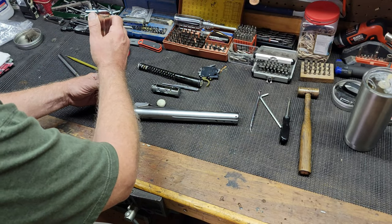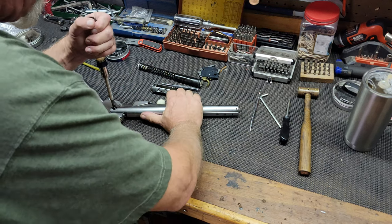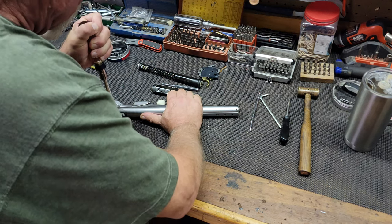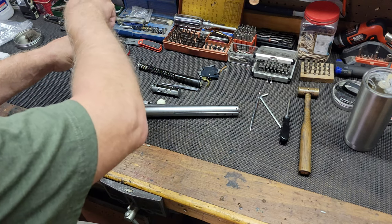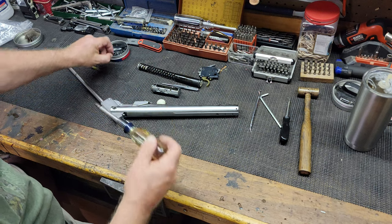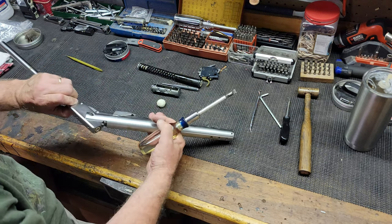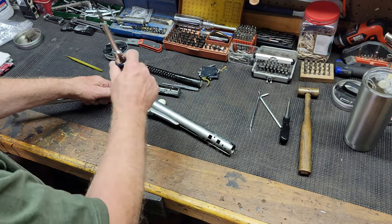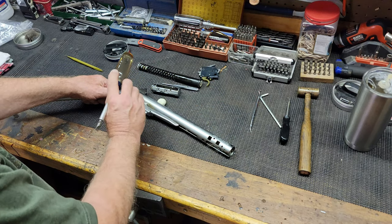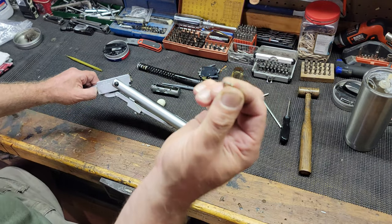We've broken the barrel, and we're going to go ahead and remove the cross bolt that holds the barrel in position. We'll take the cap off first. There's a cap screw on one side of the rifle that you take off, and underneath that is a very small washer that you don't want to lose. It's a little metal spring washer. A couple of taps, it should drop out of the gun. There it is. You're going to make sure you don't lose that. Put that aside.